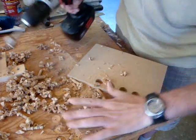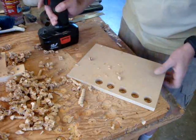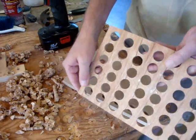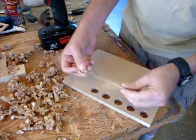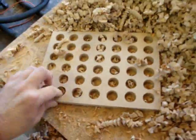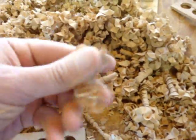Now it's just a matter of boring out 42 of these holes using a 7/8-inch Forstner bit. I'm so glad I got this MDF — look how nicely the holes come out compared to the plywood attempt I did yesterday. It makes these weird little cardboardy ribbons when you drill through it. 42 holes drilled through MDF with a sharp Forstner bit — it just goes through them just like butter. These shavings are really cool; I think I'm going to save these and figure out something to do with them.